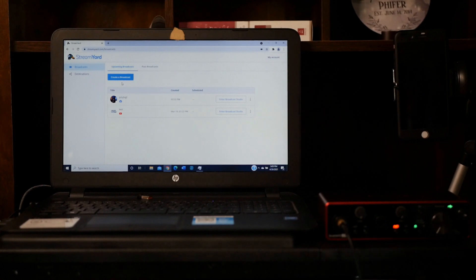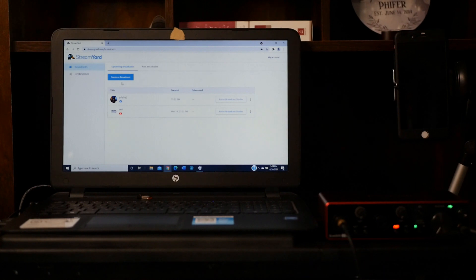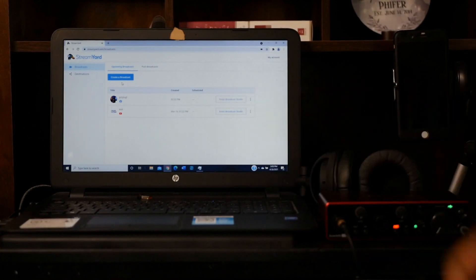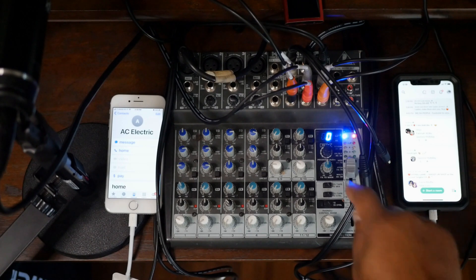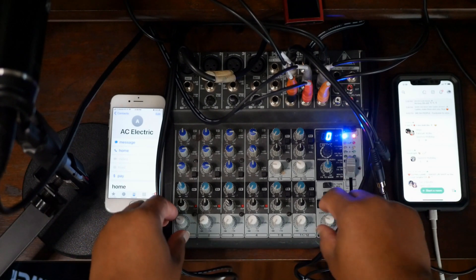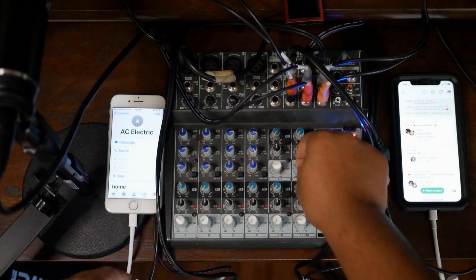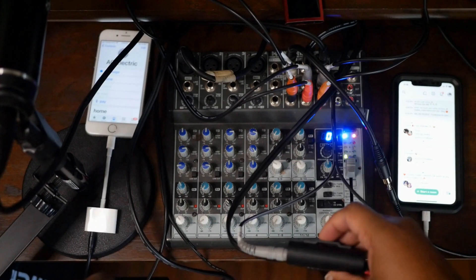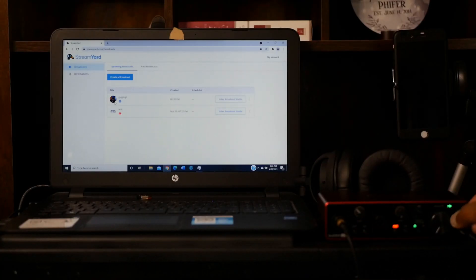Next, plug a pair of headphones into the headphone output of the interface, then plug your interface into another laptop. Wait until the computer gives you a notification that it recognizes your interface — the lights on the front of your interface should turn on. Now turn your master mixer volume up, adjust the headphone volume of your mixer, and adjust the volume of your mic channel, Clubhouse output channel, music channel, and phone line channel on the mixer. Also adjust the volume on both iRig 2s, the input volume of the Scarlett interface, and the headphone volume of your interface.